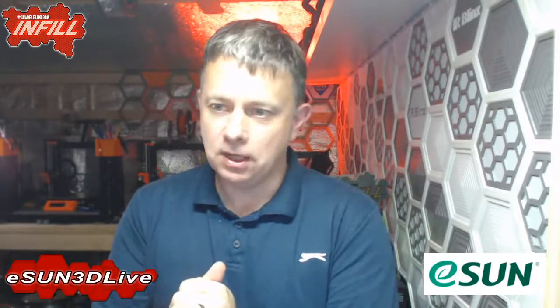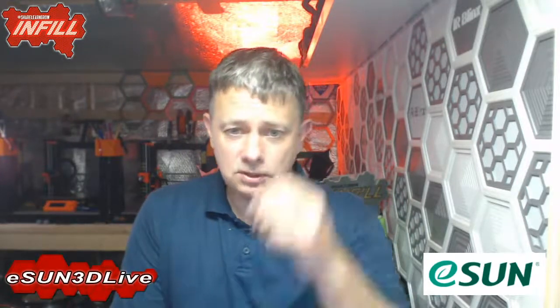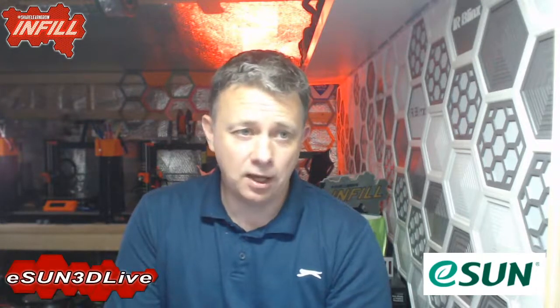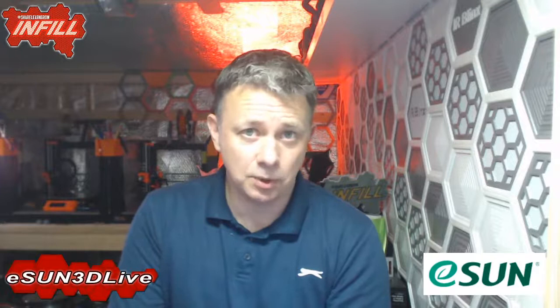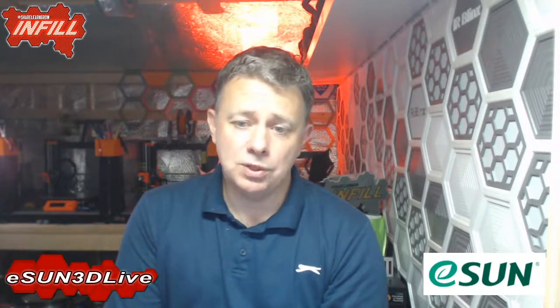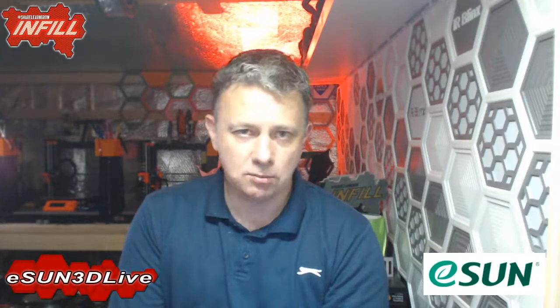So that was the TPU. As I say, I found it printing. I was printing on the Prusas. In fact, I printed it all on the Mark IIs, which tends to be my flexible machine. That's the machine that I use for that sort of thing, and printed with absolutely no issues whatsoever. As I say, once I fixed the temperature so it was down in the range that's recommended, I just went straight to the 220, the top of the range. Once I printed within that range, the finish was great, and even with the temperature way over the top, it still printed great. Obviously, it's TPU, you're going to get a bit of stringing.